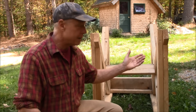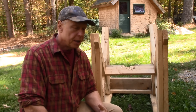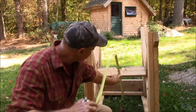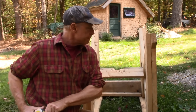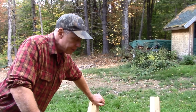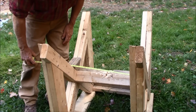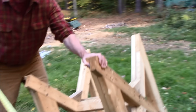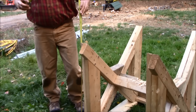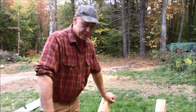Let's just pretend these are between three and four feet long because that's what I used to start off with. I didn't follow any specific dimensions — I was just grabbing scraps out of my wood pile. I'm six foot tall and I wanted to have the firewood up about 20 inches or so off the ground. These here are just about that 20 inches, and when I load this up and cut through the whole stack, that's a comfortable height for me. For some dimensions: mine is just over 19 inches long between the X's, the legs are 45 inches long, and it stands off the ground right about 34 inches.